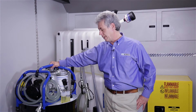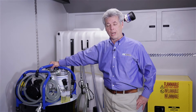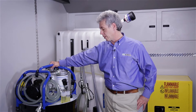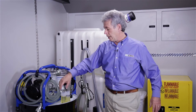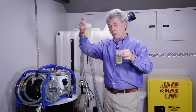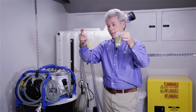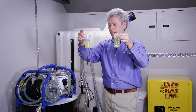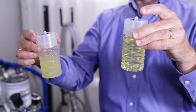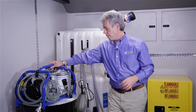We actually want to make your life a lot easier. Now, we're going to assume that you already know that if you keep your lubricants clean and dry, your equipment will last anywhere from three to eight times longer. But what a lot of people don't understand is when they receive new oil — this is a new oil sample, this is a used oil sample — they think this is clean and this is dirty, but if you actually ran particle counts on these, this oil is actually cleaner than this oil.